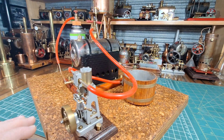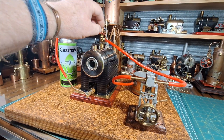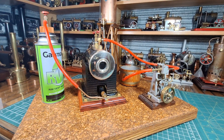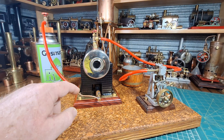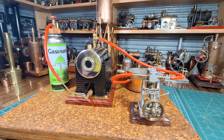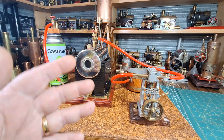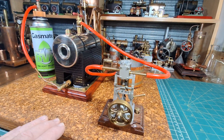Because this is gas, a lot of heat comes up from these vents here. Silicon is fine — it's virtually flame proof. It's been really good and it's a lot easier for me using silicon than always using copper lines. Copper lines are great for a steam plant that's permanent, but for something that you're breaking down and setting up all the time, running different things from different boilers and different engines, silicon tubing works fine.